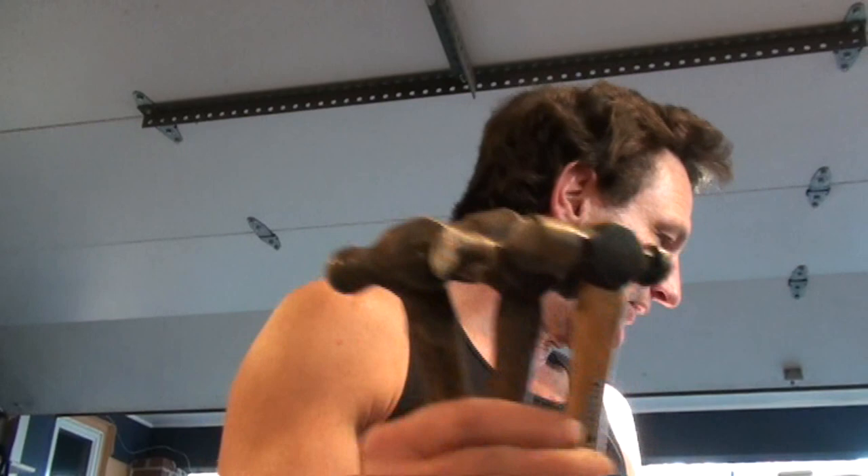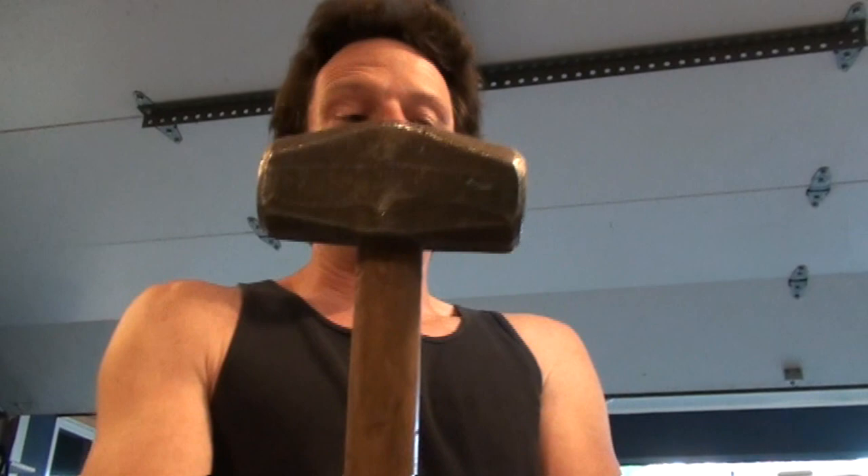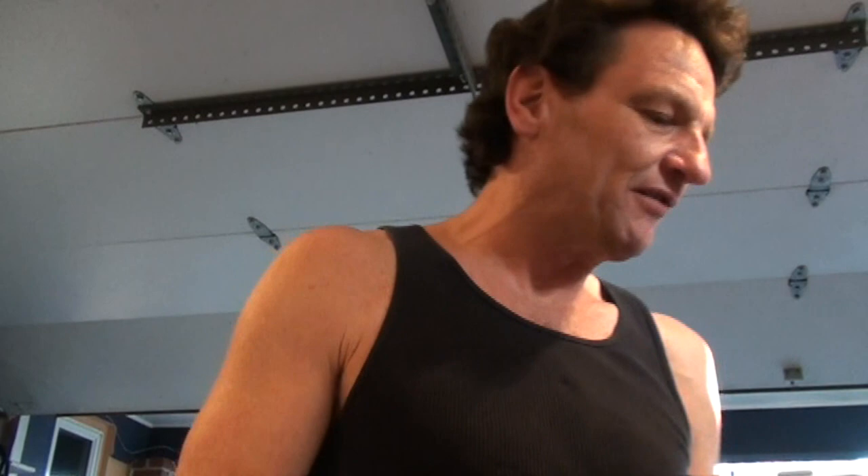Here's a body pick hammer — again for metal work, the face is totally different. This is a mallet filled with lead BBs so it doesn't bounce — they call it a shot mallet. Ball peens come in all different sizes. And here's a five-pound sledge, for hitting chisels or knocking fence posts into position. This is a non-marring mallet with a hard nylon end and a rubber end — for banging on something delicate without leaving marks.